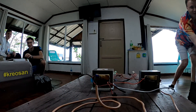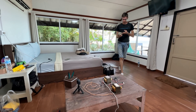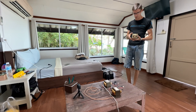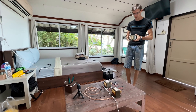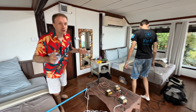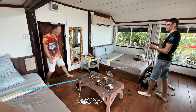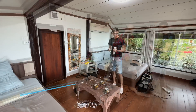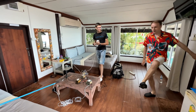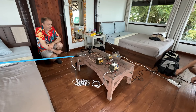It almost turned on me — turn it off. But of course we won't stop there. Two transformers is not enough, so we will connect the third and then the fourth. The arc must be long to the ceiling. I want the arc to reach the ceiling — if it's up to the ceiling, it will be hard to stop and could get out of control. Three transformers is already 6000 volts. I'm a little scared. The most important thing is the shoes — they should not conduct so that we are not shocked by the current from the ground.